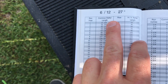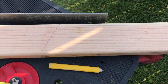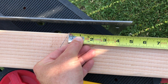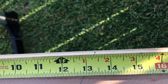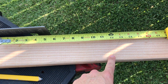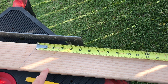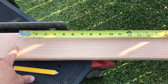Alright, here was my plumb cut. I made my mark on the board right here. See how I got my square right up to it on 6 and 12. And now I'm going to mark this — that's going to be one foot. From this line to this line should be 13 and 3 eighths, just like the book of rafter tables tells me. So we said a 6-12 roof, one foot of run would be 13 and 3 eighths. I did the step-off method with the framing square, so let's measure it. I'm holding the tape right on the end of my mark and going down to the other step-off — 13 and 3 eighths on the money. If the width of the building was two feet, you would do a one-foot step-off and the bird's mouth would go right here.